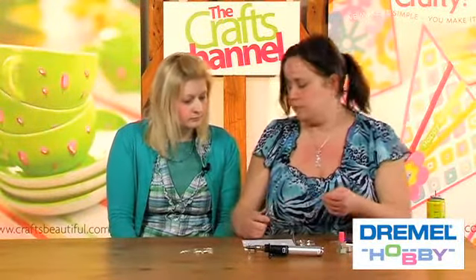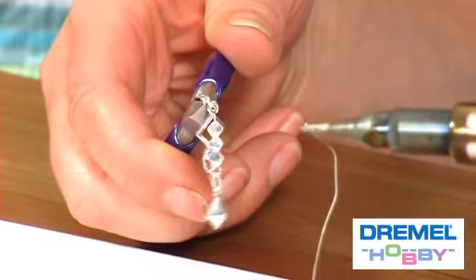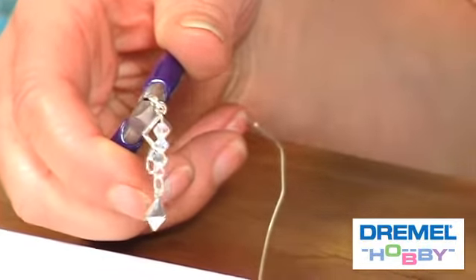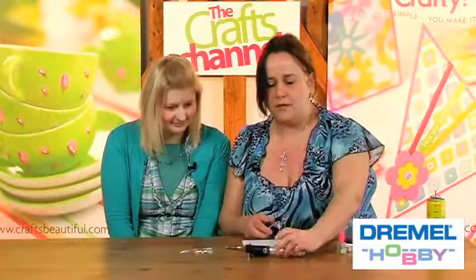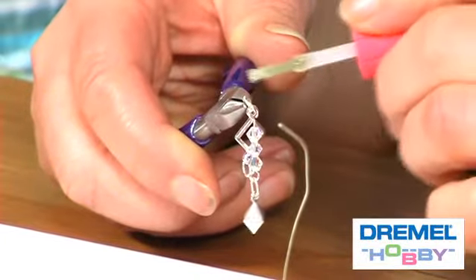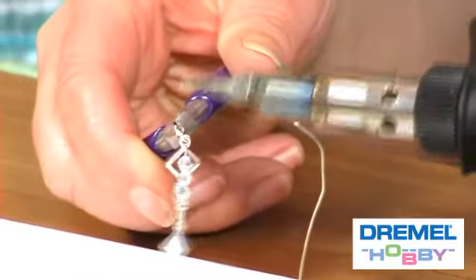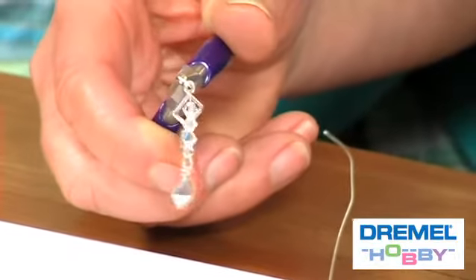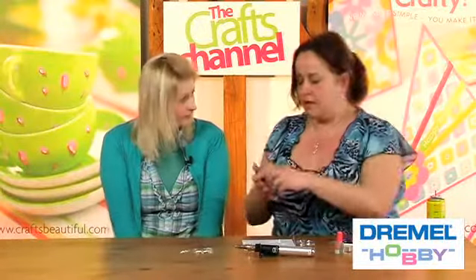These pliers are quite small — you would be better with larger pliers. The join is right there, so you need a tiny bit of solder on the end and literally just place it on the join. I didn't flux that one — if you don't flux it, flux actually makes solder flow more easily. But if you've forgotten, you can always flux over the top of it afterwards. For large soldering projects, flux a little bit at a time because it evaporates. It's easier doing it a little bit at a time so you remember which bits you've done and which you haven't.